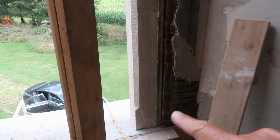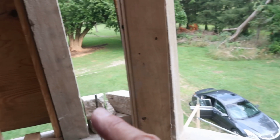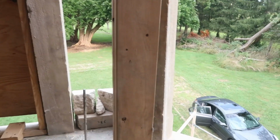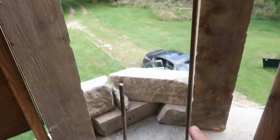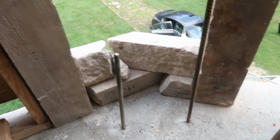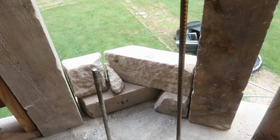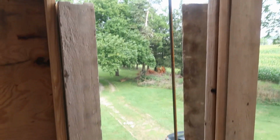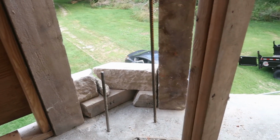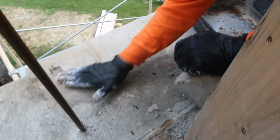Well, Frank went and set up these vertical pillars that are on each side of the window. They are not mortared down yet, but right now they are straight and true. He has these numbered, again just set in place to check his grout lines. He has the story tape as well. I'm getting ready to do some hot lime mortar and we'll go from there. Frank is priming them, getting them ready to mortar into place.